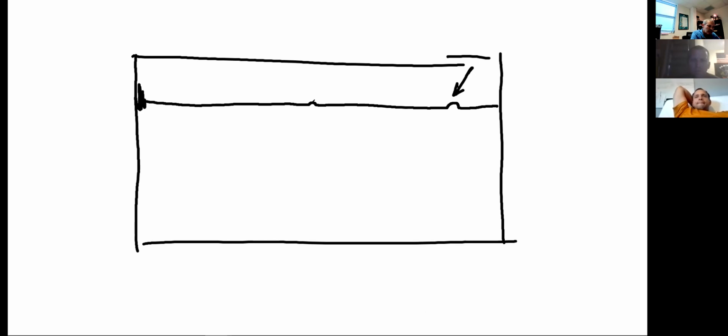Some faults are so minute in the ground that they're undetectable. Some faults are so intense that it burns the conductor completely in two. If it burns it in two, it thinks it's the end. So you need to verify that. Here's a very simple way of doing it. Put it in radar mode.